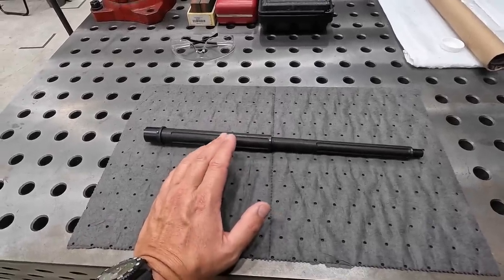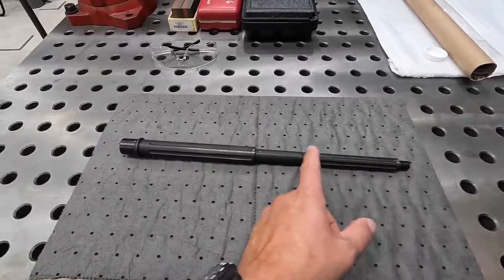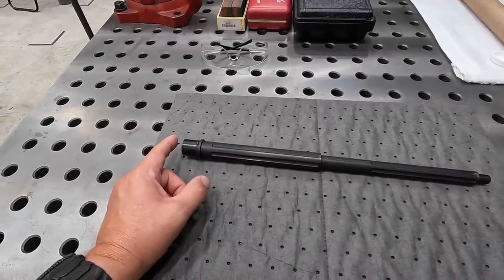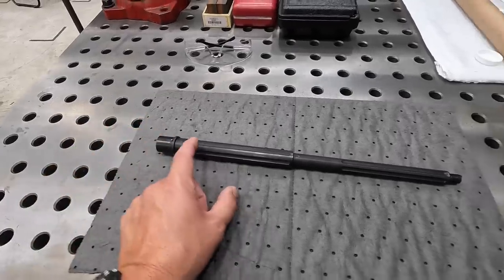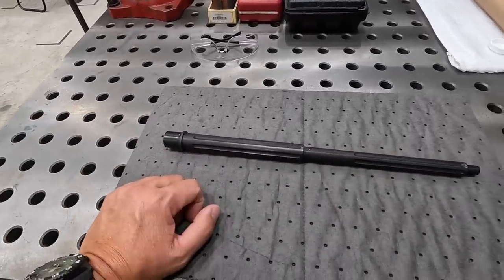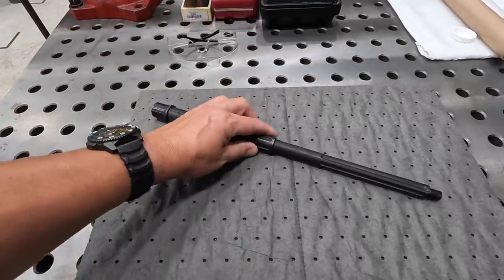but the important thing to remember is that when you make your very first cut with your workpiece, you need to cut to the spindle, because that helps seat the drive dogs in the material. And then once you do that, then you can turn each direction there. All right, but pretty cool example of one of the parts that you can make.